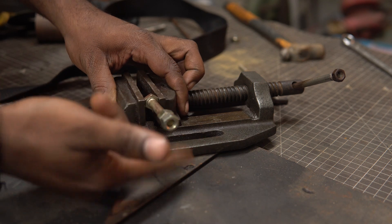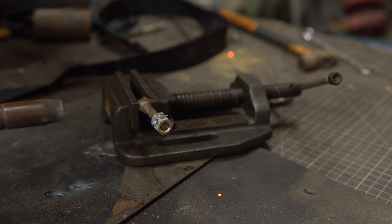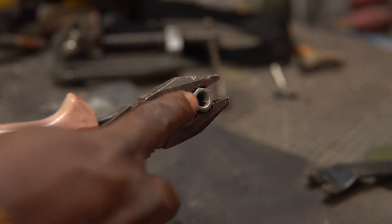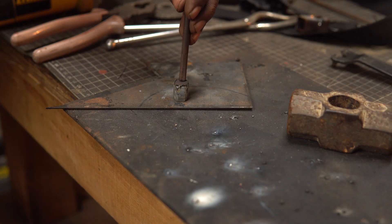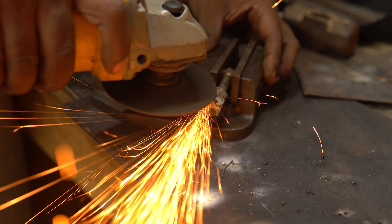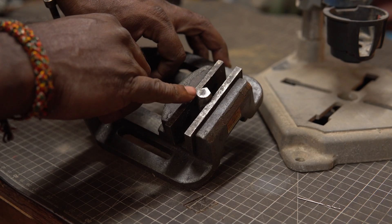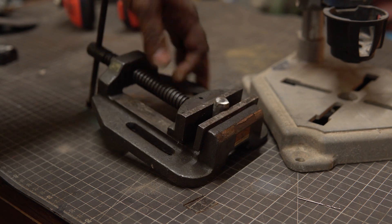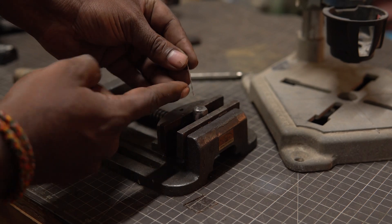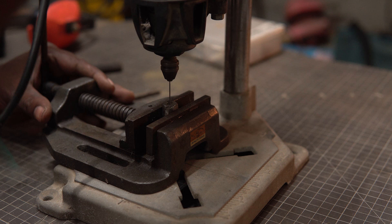Here I'm welding two nuts in tandem to make a longer nut — I could have avoided this if I had a coupling nut. The nut is slightly longer now. I'll have to seal one end of the nut. After grinding and cleaning the welds, I sealed one of the ends making sure I used a thin metal sheet. The seal on top of this nut was sanded as much as possible, because a micro drill bit will not be able to drill through thicker material. The thinnest drill bit I had was about 0.2 mm, and slowly and carefully I made a really tiny hole.